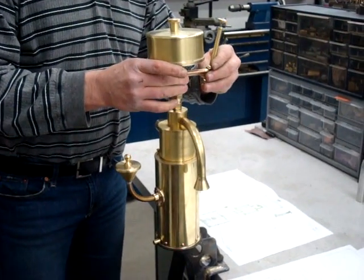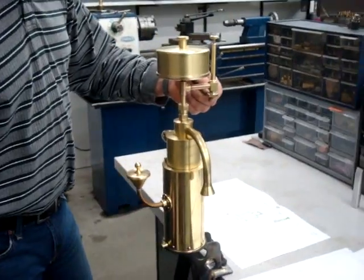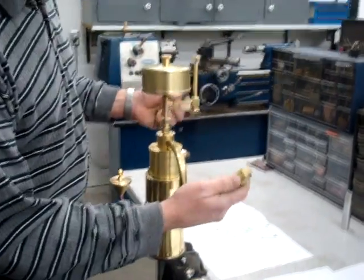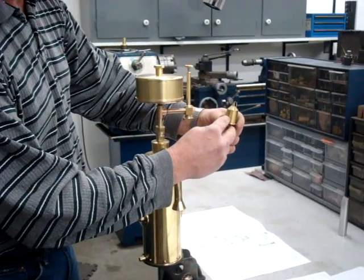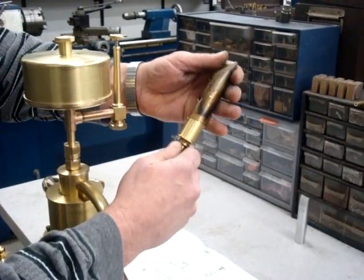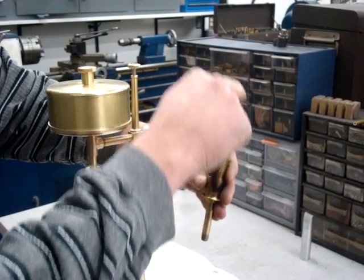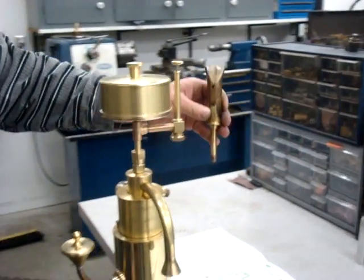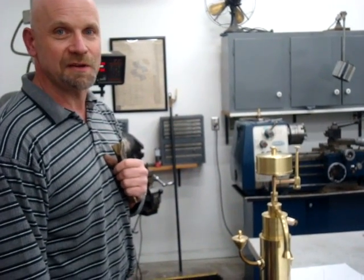This is the fuel shut-off valve. There's going to be a pipe which comes from here and goes down to the hot tube of the engine. There's a burner, and this is the supply line to the burner. This chamber is a boiler — there's about three quarters of a cubic inch of space in here. This is the power line with a 13 thousandths hole that shoots the gaseous fuel up through here. Air is mixed in here and the flame on top heats the hot tube that sticks out from the engine. And there you have the reproduction system for the flash carburetor on an 1883 Daimler high speed engine.